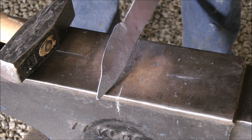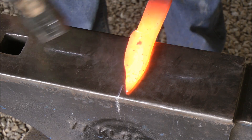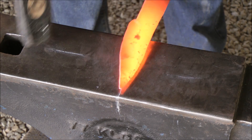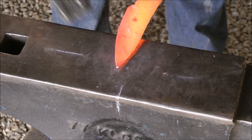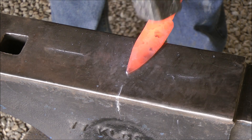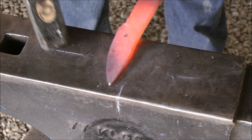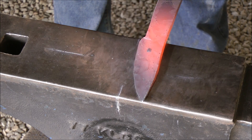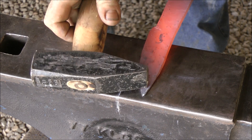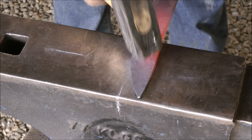You can see I've still got red in the blade, but that edge is already black — so no hitting that. Moving on to the next section: one, two, three blows, flipping it around. My hammer blows become softer as soon as I get to the edge, making sure everything is consistent on both sides, getting rid of the irritating fire scale. Now what I'm doing is moving up in the middle of my blade, flattening things out.